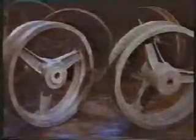The simplest way of die casting is to pour the metal from a ladle and let it fill the die under gravity. Here they're using gravity die casting to produce high-performance wheels for racing bikes from magnesium. The mold, we call it the die, is made from a fine-grained cast iron, and it consists of two halves.